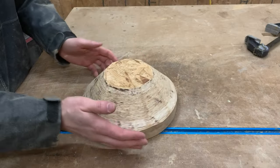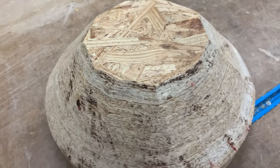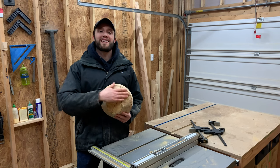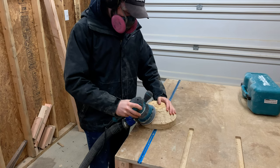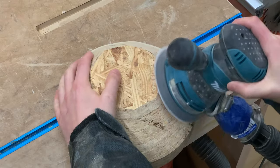After all that, the bowl is pretty round and now we have to get to more shaping. Now that we've got the rough shape of the bowl down, we're going to start carving everything to smooth it out. Since OSB is pretty soft, to work on the outsides we're just going to use the sander. An 80 grit disc on the random orbit sander was all I needed to smooth out all the ridges from the table saw.